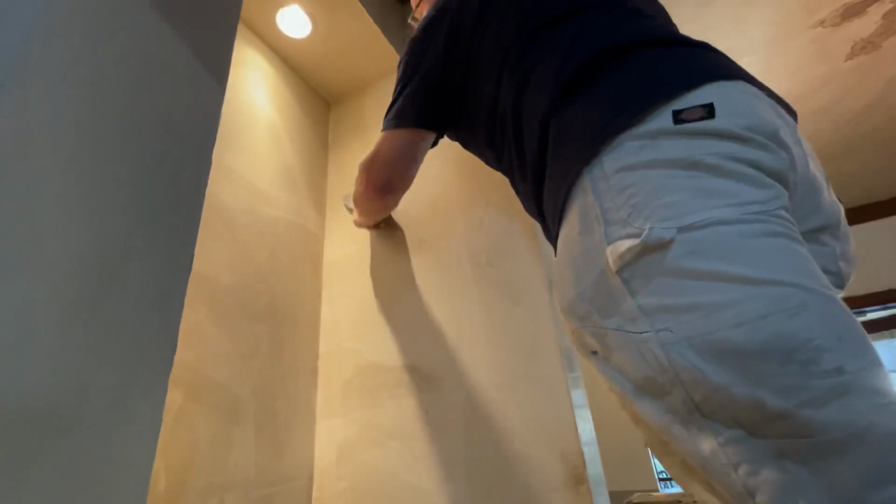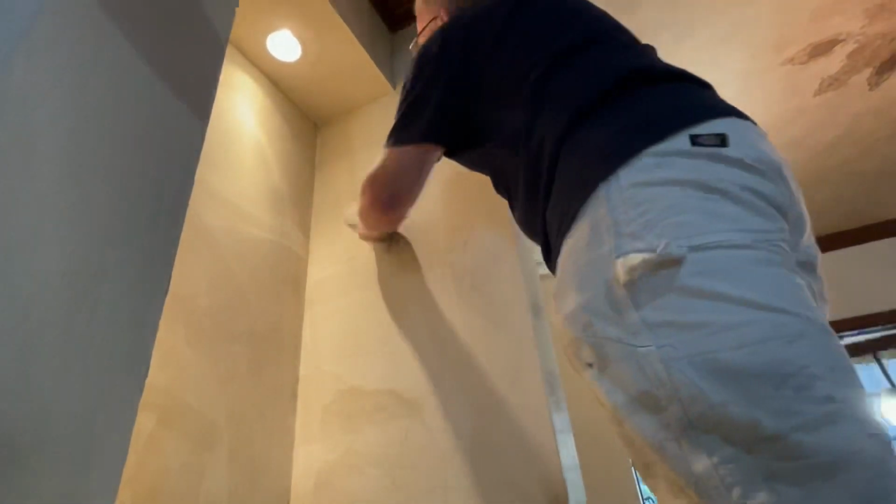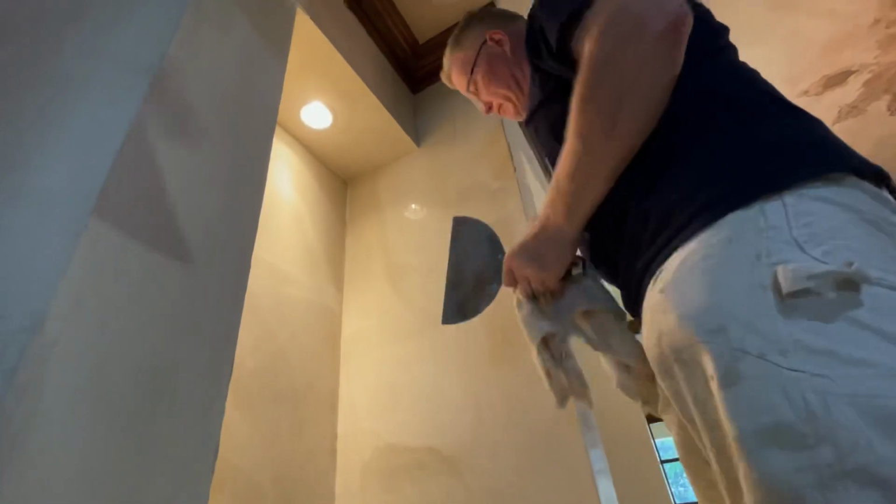Okay, be careful when you go up, because you can scratch it. And you don't want to do that. Look at how beautiful. As I'm standing close to my Venetian plaster, I can see the shine coming out. I can see the shine that I'm creating by doing this. Now, this is hard on the hand, on the shoulder, I should say, but you have to do it on a day when you got all your strength so that you can get the most out of the burnishing effect. Okay, look at that beauty. Look at that.